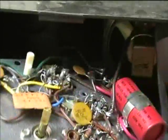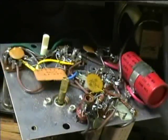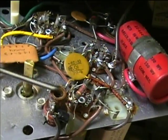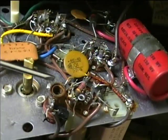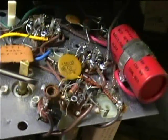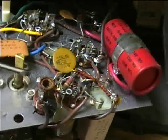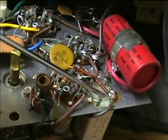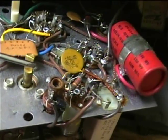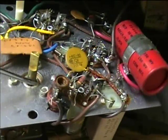We've got the antenna coil here and the variable capacitor here. Let's take a look underneath and see what's down underneath the chassis. Here's the oscillator coil, and this is what works with the incoming signal to make the 455 kilohertz signal. When you mix two signals together, you get both a sum and a difference frequency. But since the IF transformer is tuned to only respond to that difference frequency, that's all it picks up — the sum frequency is just rejected.